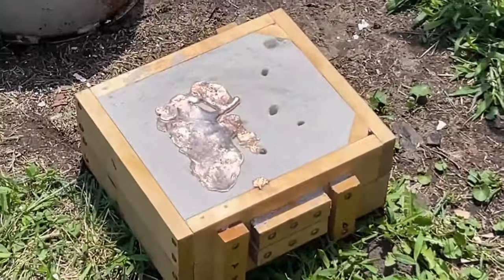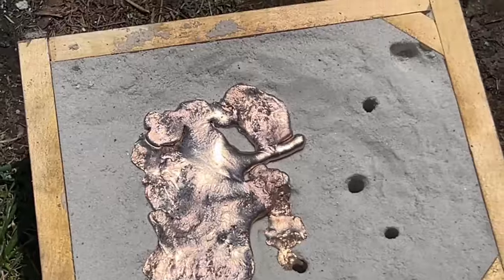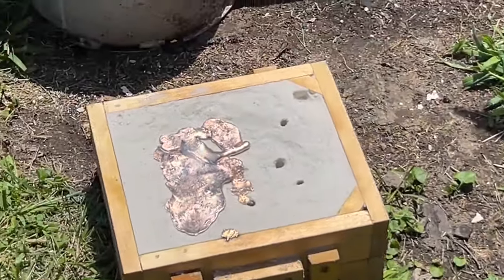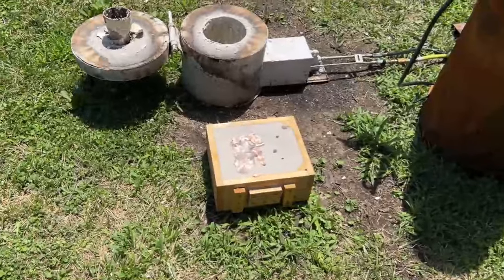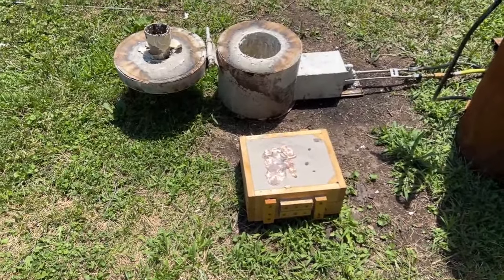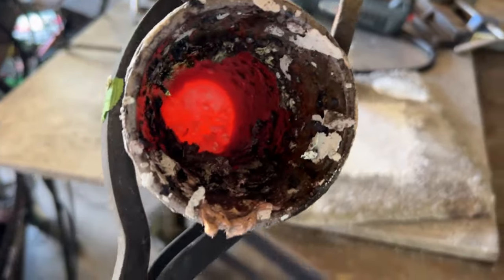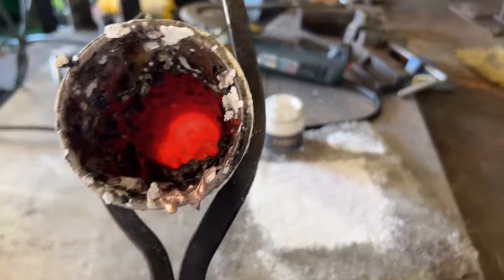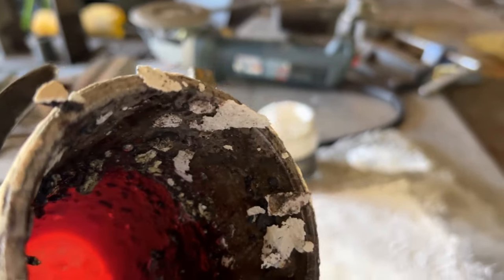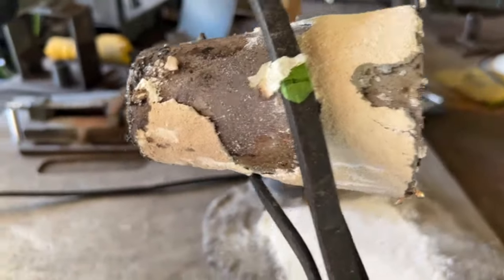That'll give me enough of what I need to work with today, I think. Yeah, I botched that. I did not do a very good job there. You don't have a lot of time, so you find yourself very stressed for thought. And I didn't have much time to think about what I was doing. We'll do better on the next one. All right, that last little bit didn't want to pour out, but it's good that we're not seeing a bunch of that zinc fur. That white stuff you see there is off the refractory paint and the crucible paint.